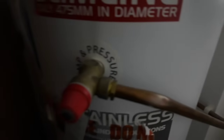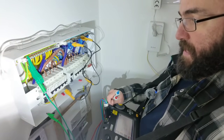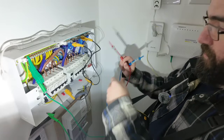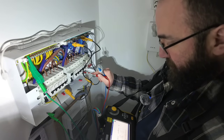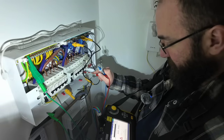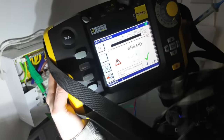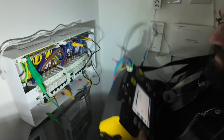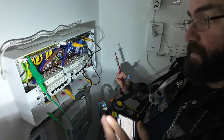I'm going to connect onto the earth bar and then onto the busbar at the bottom. Taking our probe, I'll go through the first set of circuits, press test and hold that down for about five seconds. This device has a timer on it. The reading is 499 megohms — so that's all of these circuits tested together. That's going to be my value for that test. I'll do the same on the other group.